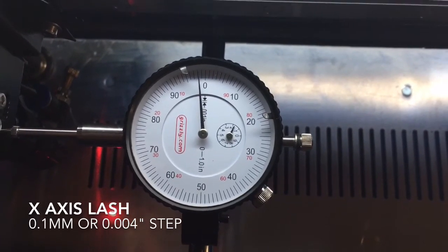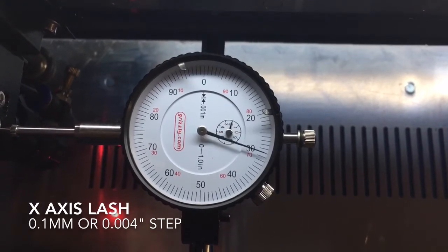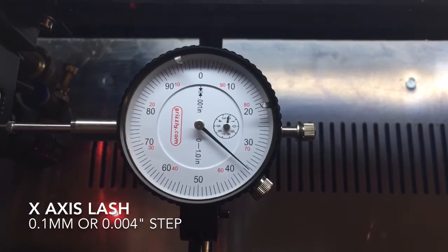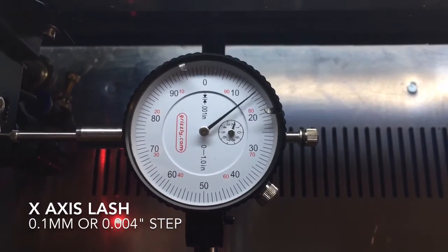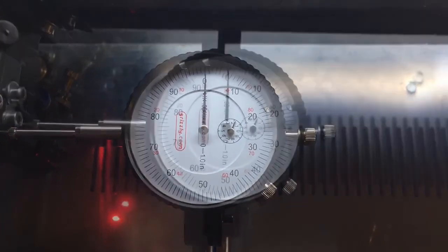1, 2, 3, 4, 5, 6, 7, 8, 9, 10 — and we've returned to zero. So again, as last time, I've now changed the step size to half a millimeter, which is, I think, like 19.7 thousandths. Three of those steps should be 59 thou, putting us at around 41 thousandths.